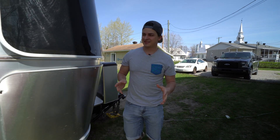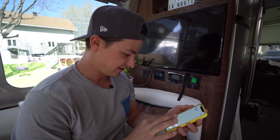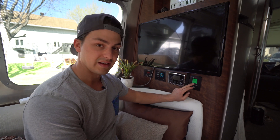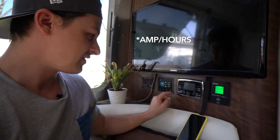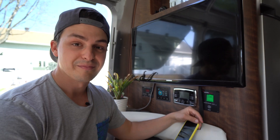The learning process is now complete, so it's time to test running the AC off the battery. I turn on the inverter — a 2,000-watt Samlex — and the battery is at 99%. The fan kicks in and I can see 19.4–19.6 amps on the inverter. We wait about 30 seconds for the compressor to kick in — but then there's an input fault. I'll call Microair to find out what's going on.